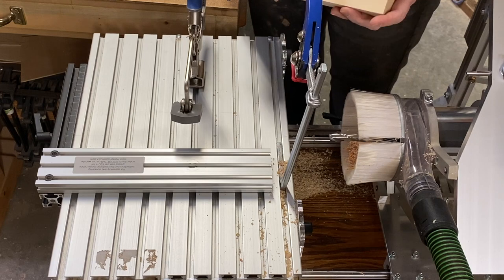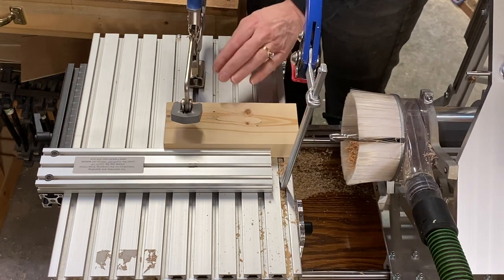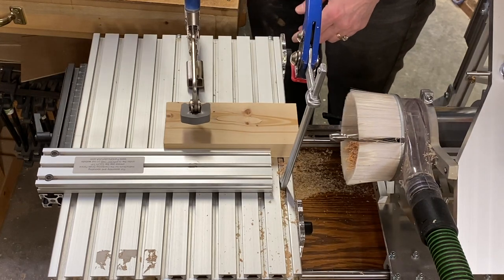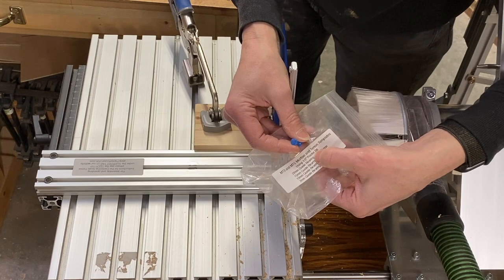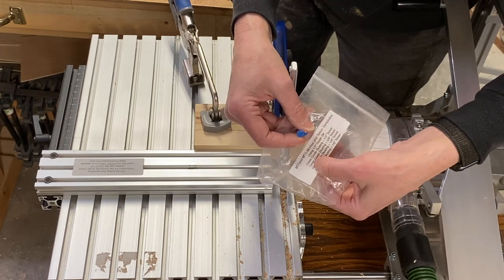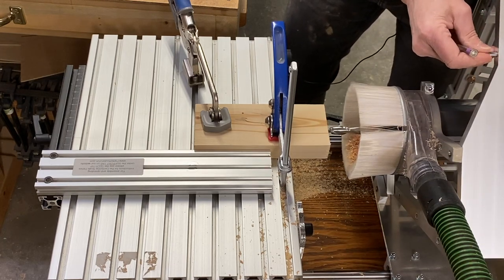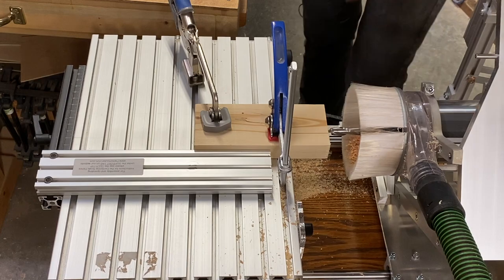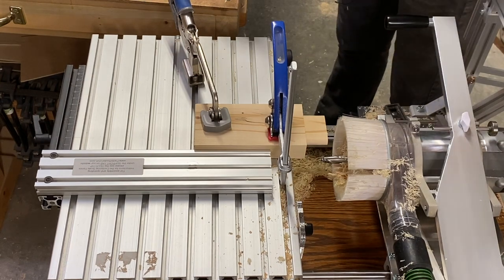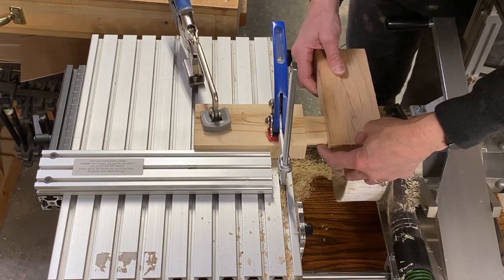For the tenons, I'll be using my test piece again that I've already got to the same thickness and width as my other pieces. This is just to see if that tenon will fit nicely into the mortise. The guide says for a half inch router bit, if I want a one-half inch tenon, I'll be using a 22 millimeter bearing guide. I set it to the widest setting possible so I can always come in closer if I need to. The advantage of the test piece is that I don't have to bring that huge piece of work up here - I can leave it all clamped in.